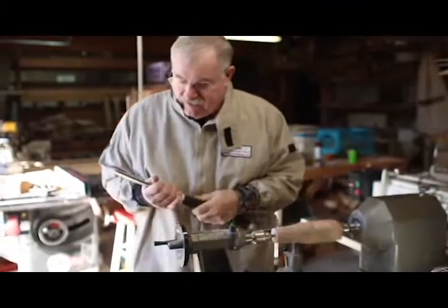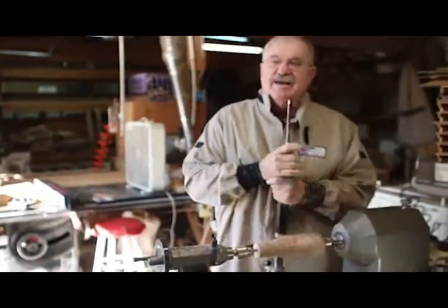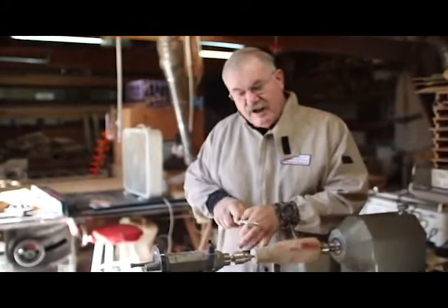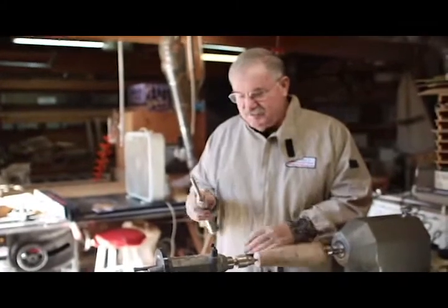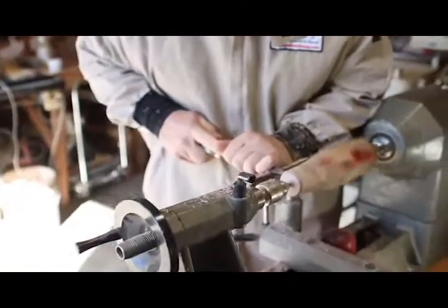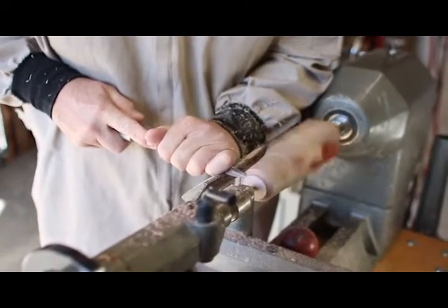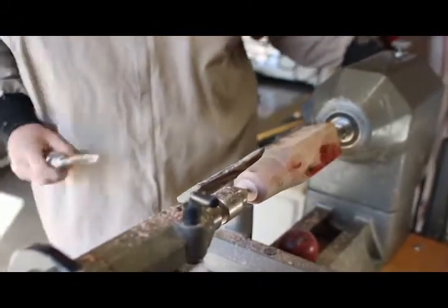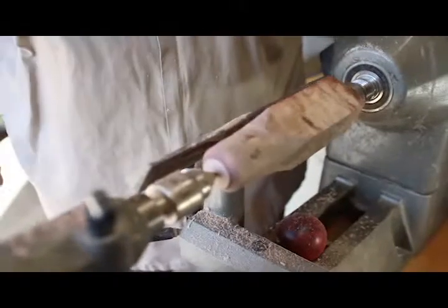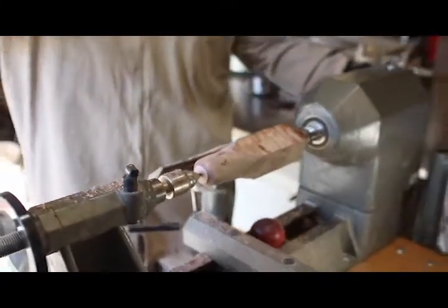Now the other cut for the stabilized wood is a little different. It is what we would do with the spindle gouge, or actually shaping the wood. You have to wind up again, just as we did with the spindle roughing gouge, cutting a little more directly across the grain. And again, if you do that, keep in mind you're going to wind up with a very nice smooth surface. And this goes for things like turning beads and coves also. You need to keep your blade cutting across the grain. Treat it like it's end grain all the way along the piece.